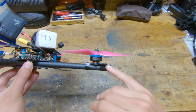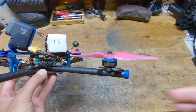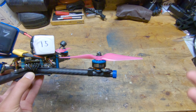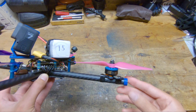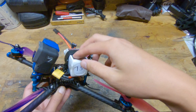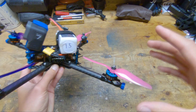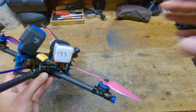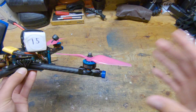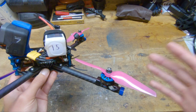So going with the smaller stator size just saves more weight. I find it kind of hilarious that people on 5-inch are running 2207.5 or 2306, but that might make sense if your quad is a lot heavier. The KV is also very low at 1922KV on 4S. The reason for that is I don't need a lot of RPM to create a lot of thrust because the quad is so light. And by going with a lower KV, the sensitivity of the throttle stick is lower, so it's just easier to control the quad.